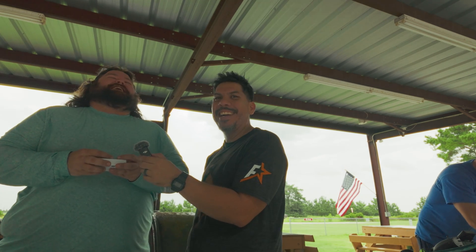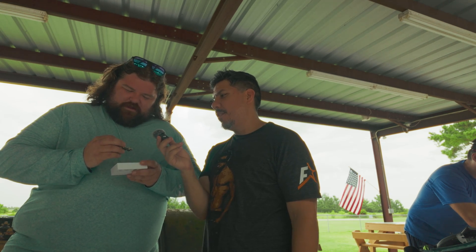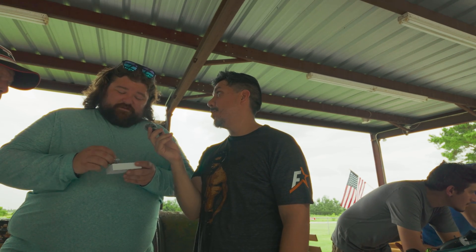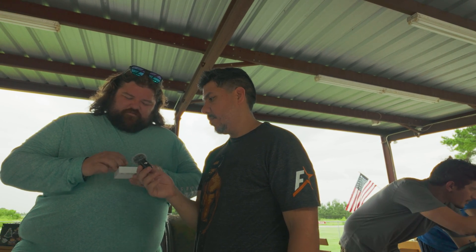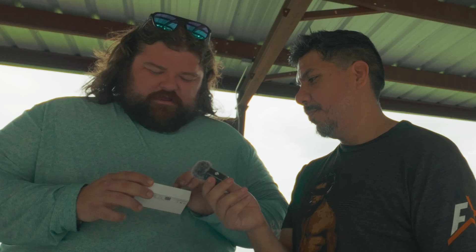How long did it take you to build back in the early days when there were no instructions? Oh, like 13 days — legit. It's come such a long way. Dual PCB, copper strip on the bottom acting like a mini heat sink, conformal coated. You don't even have to fly HD Zero — it's friendly to all systems. Having a DJI plug is smart because there are so many freestyle pilots in the DJI market who aren't into HD Zero but would buy this equipment if it's this easy to build.